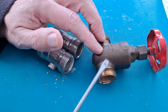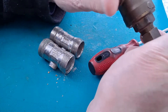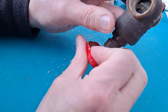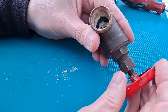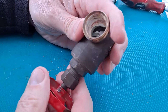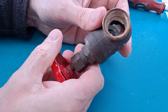This one, which fed the hot water, I couldn't move — well, I could move it just that much. You probably can't even see it moving. That's as far as I could move it. So this is the old one — it's replaced now. And you can see in there, it's stuck half open, which was interesting because we'd always thought we had very slow flow on the hot water. And that would have been the problem — it was half closed.